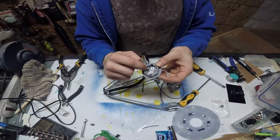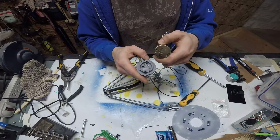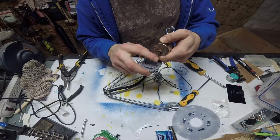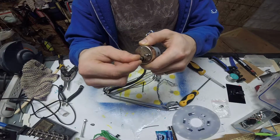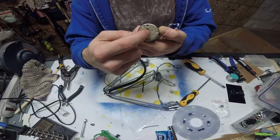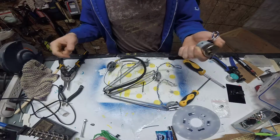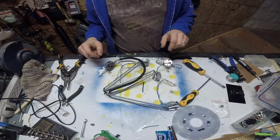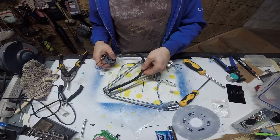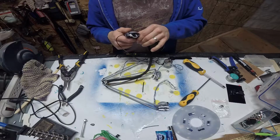This here, the gear pushes against the plastic, and it eventually erodes and pushes away because this is not tight in there at all, and it moves. So it has a little bit of play, and it'll push away from the filament. It has to push down this Bowden tube here, where it seems like there's a lot of friction and it's getting jammed a lot.